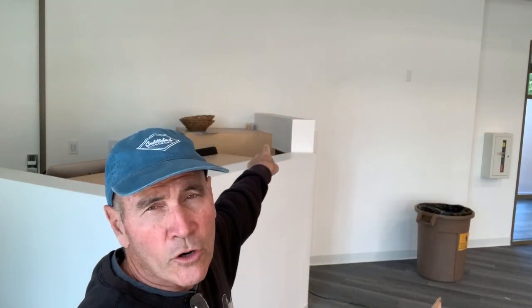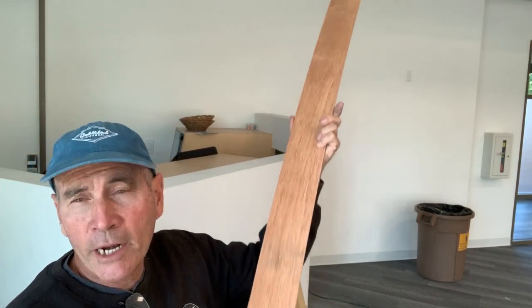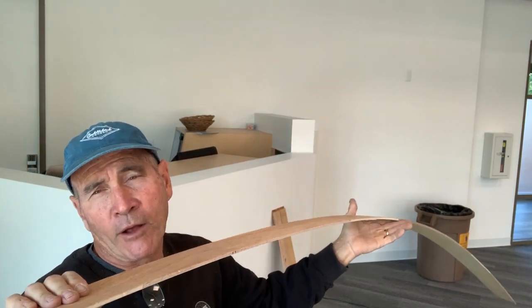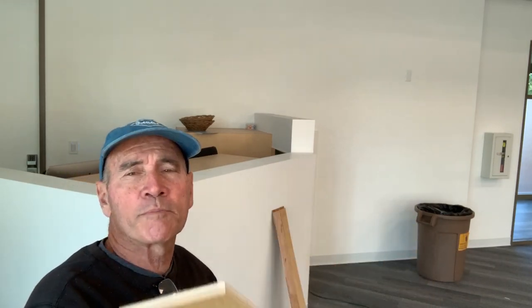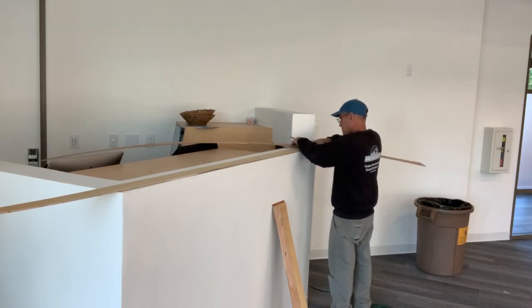This is the pattern I made for that little short wall — it's quarter-inch plywood that I ripped into strips and then hot-glued together. I learned this little trick from the guys that do granite tops for kitchens. Eighth-inch plywood or door skins actually works better for this process, but I had this quarter-inch laying around that I wanted to use up, so I ripped a bunch of strips three inches wide to make my patterns with.